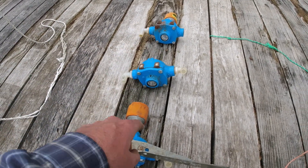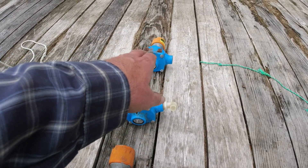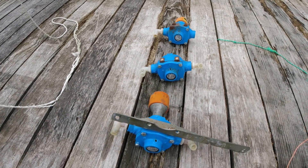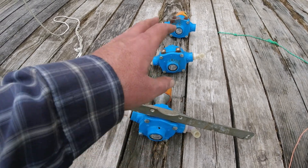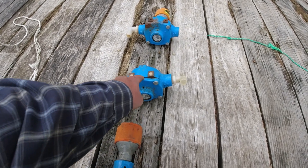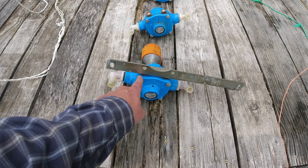I've cracked them open to put kits on, but invariably on these cast iron pumps the inside surface gets rust and it starts to pit. I do my level best to clean these pumps and make sure the chemicals and herbicides are out of them. I'll put antifreeze — RV antifreeze or something like that — in them in the wintertime, but they just don't last. This one was kind of the final straw; I should have gotten more than one season out of this one.